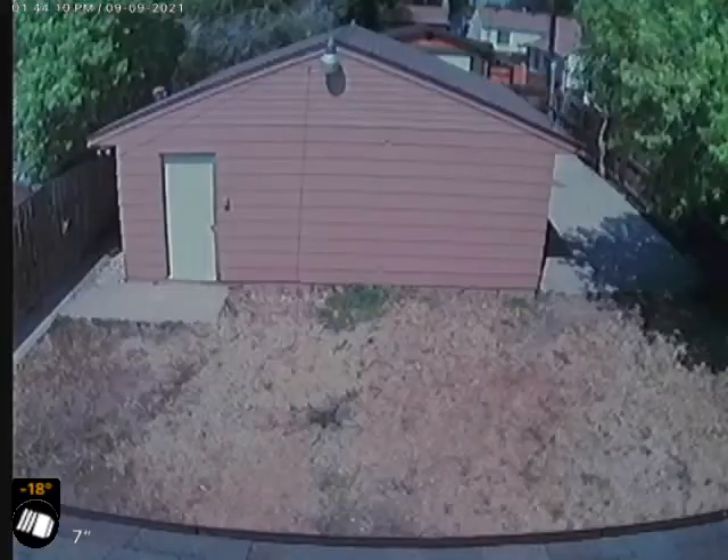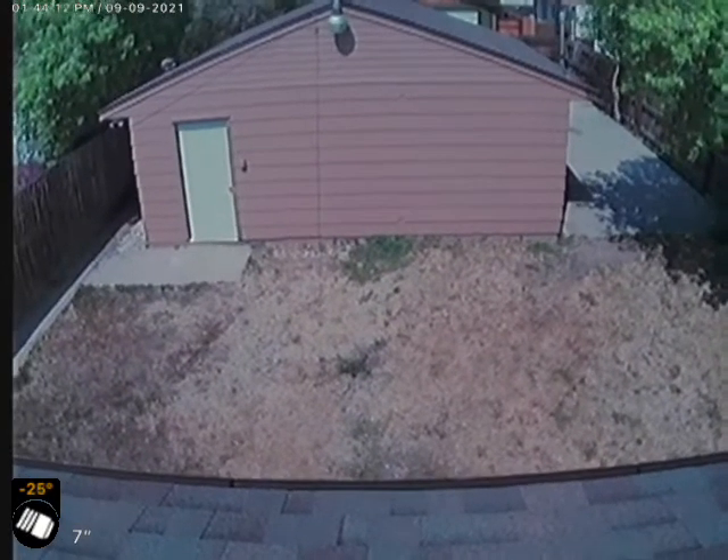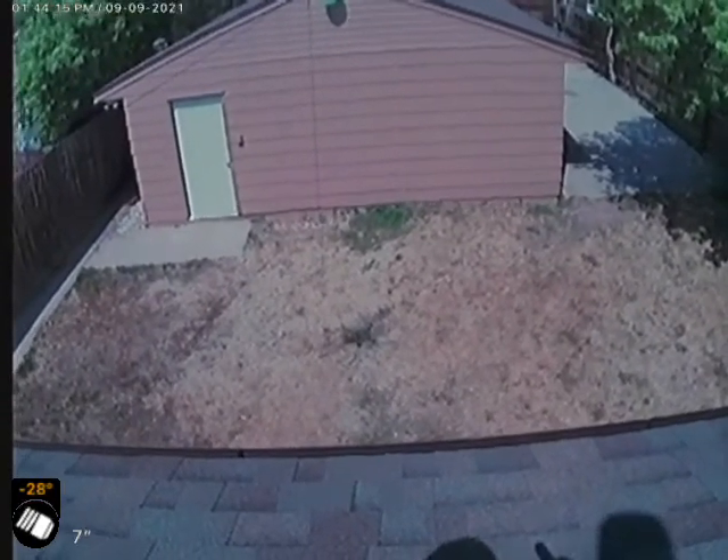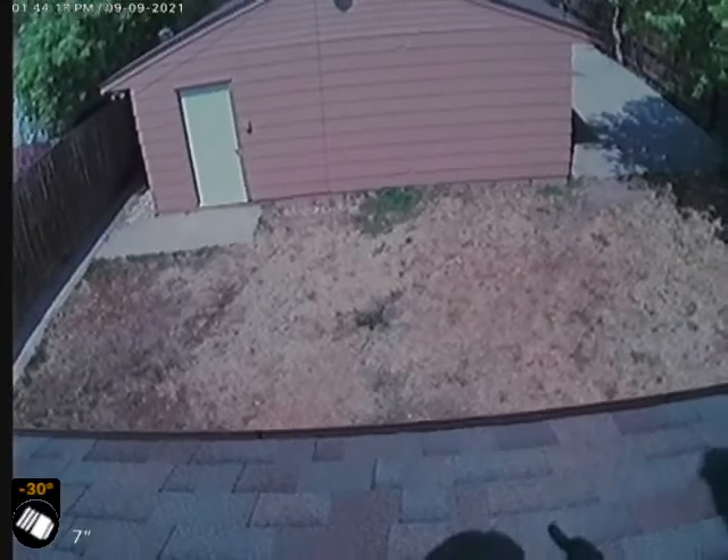Right here we make our swing up — we're going to come up the vent. All the water is running off the head so it makes it really hard to see, and David's trying not to make a mess here. So we're out of our vent — there's our vent. Let's show that backyard. I believe that Orangeburg is underneath this yard right here — 30 feet to 50 feet would be just about this distance right here in the backyard. We'll take it back, we'll review it and we'll go from there.